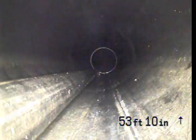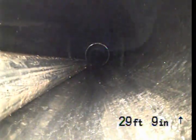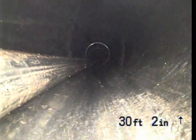I'm going to make a recommendation after I review the video one more time on a bigger screen. You need to do a spot repair for sure, but possibly a spot repair and then shoot an epoxy liner to the center of the street, or all those roots are going to come back. By the way, the sewer line runs right underneath the center of the sidewalk where you have a humongous tree.